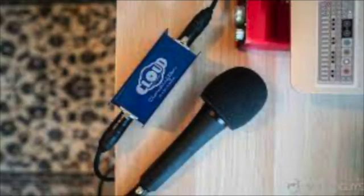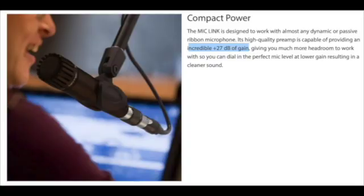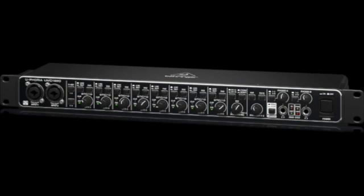To combat this, you can get a mic booster like a Cloudlifter. And I think Behringer also make one that gives you like 25 dB of clean gain, apparently. With the Apogee, the signal was boosted well and very clear with limited noise. And you can hear that in this narration, which is going through the Apogee. I'll switch now to the Behringer and you'll notice a significant amount of noise.